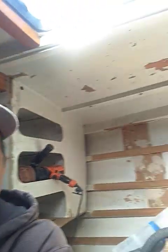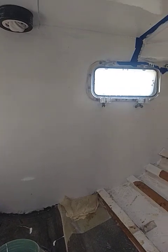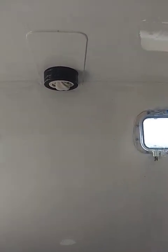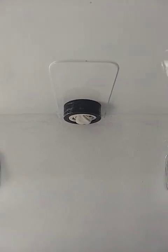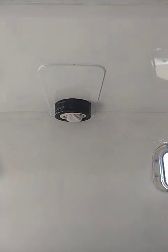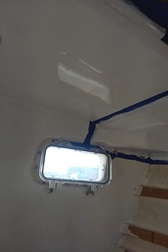I have been working on the inside quite a bit, which you can see here. If you saw the pictures, which you can look up on the website, this whole transom was modified. It took some extra wood and weight out of there, and that's all been prepped. We got in the upper rudder bearing housing. Well, that's the rudder bearing itself, and the shaft is going to slide up through that. It's not glued in, it's just sitting there. The deck reinforcement's been done on both top and bottom. All the surface has been prepped, and we've got it in.